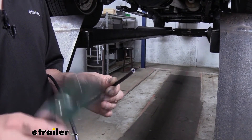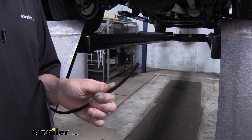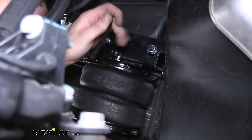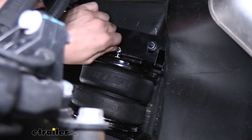If you were to use something like wire cutters — something that squishes the line before it cuts it — it deforms and you don't get a nice clean square cut. So here we can see the end of the air line. We've cut it nice and square. It just pokes right into the quick connect fitting. Just push it in place.